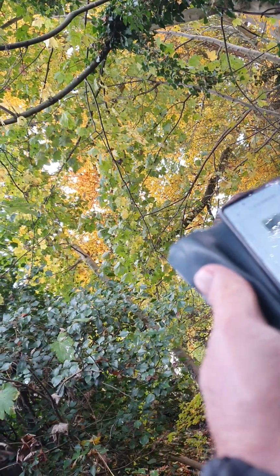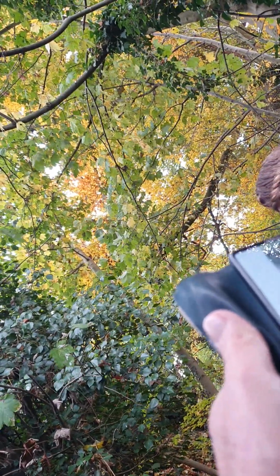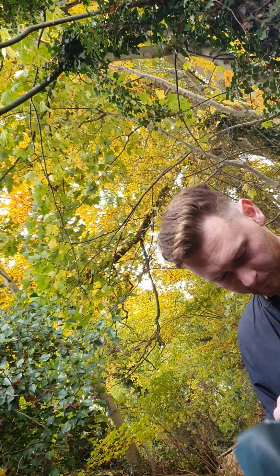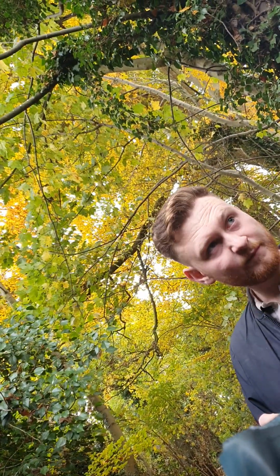But it may be what you find as well. Here you go. So I've said 750. 750 of compacted. Happy to work that out, but excavate out, compacted hardcore in layers, and then you start casting your concrete on that.